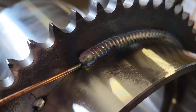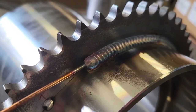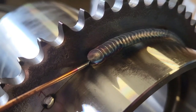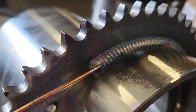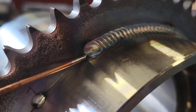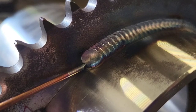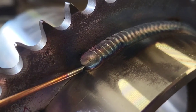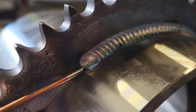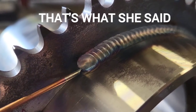I do feel it pertinent to tell you that I am feeding this from the bottom right into the weld — not really running into the puddle, but running up to the front of the puddle and letting it fill up at the same time. That's controlled by the angle of my torch. With the torch pushing, you can just push the rod to the very front of the puddle and it will basically suck the rest of the weld into a puddle right there.